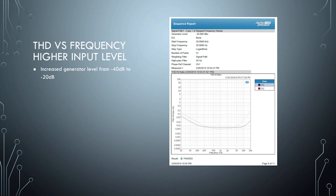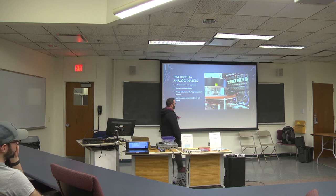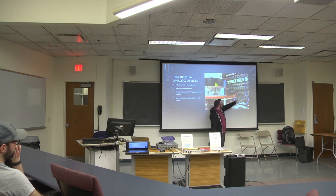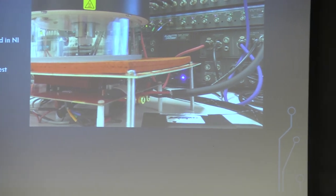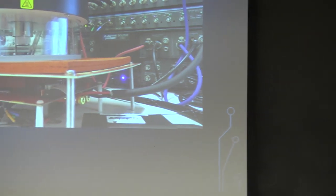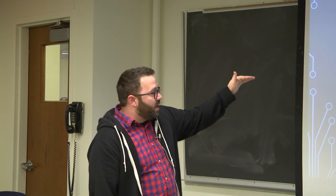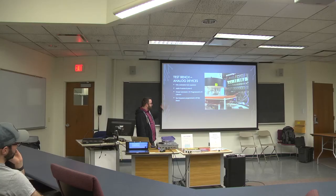In the lab at work, this is the sort of thing I do. We saw pictures earlier of the 2700 — these older boxes. What's really great about them is their flexibility — we can program every function they do. We don't even really need to run the Audio Precision software; we can program virtual instruments in LabVIEW that control every function, and program it all in TestStand, and just hit a button to run through a test.